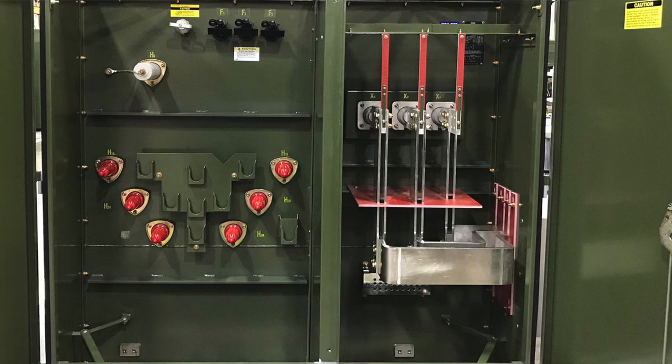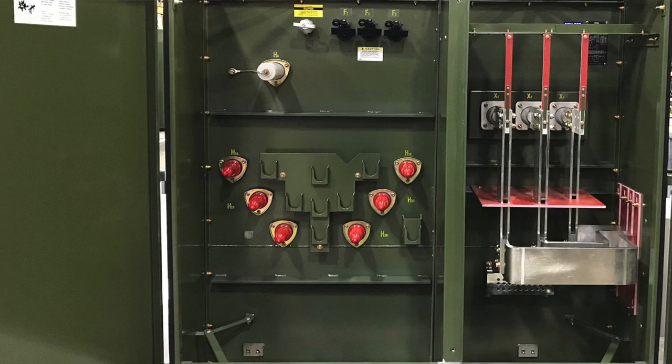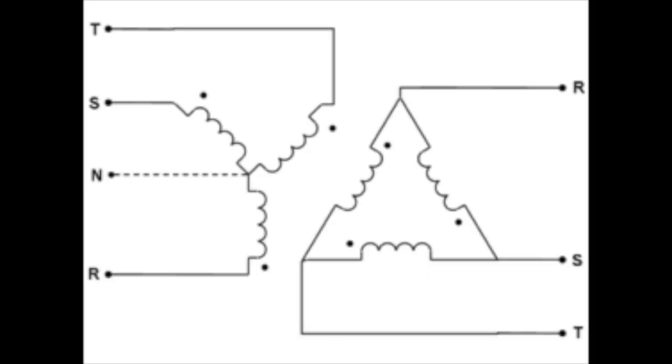And they had to run two transformers with that voltage. Each transformer stepped the 13 kV down to 500 volts at a lot of amperage. And then that would go inside the control room. Now what they did is they used two different transformers, and they stepped the voltage down to 500 volts delta on one side, and then 500 volts Y on the other side. And that's the way the power is phased. That's how they phase the transformer internally.